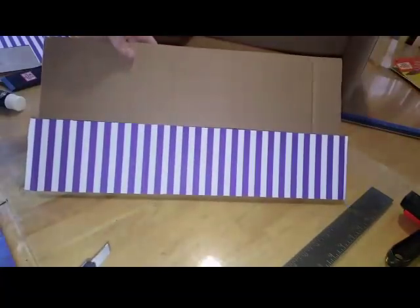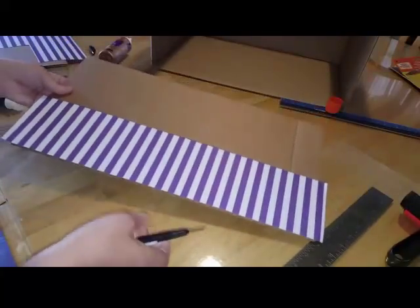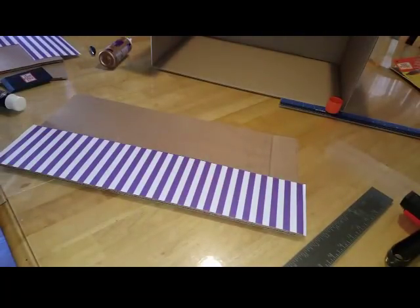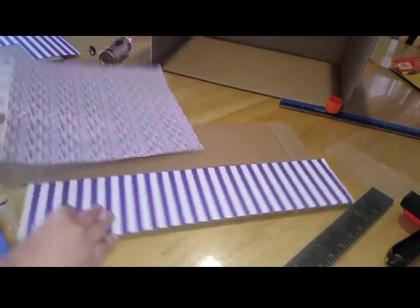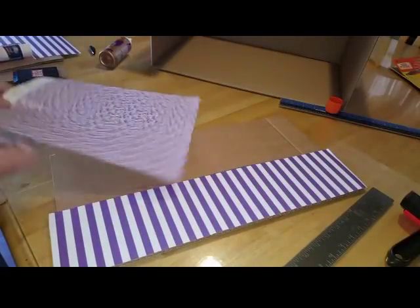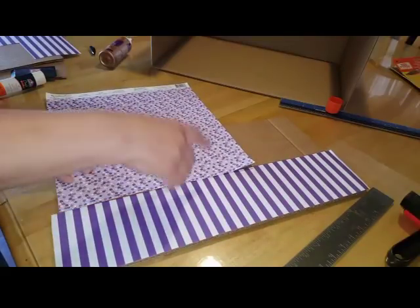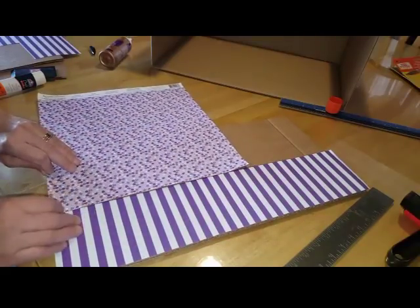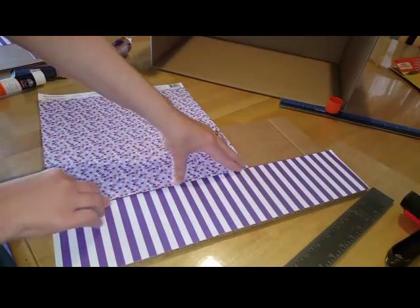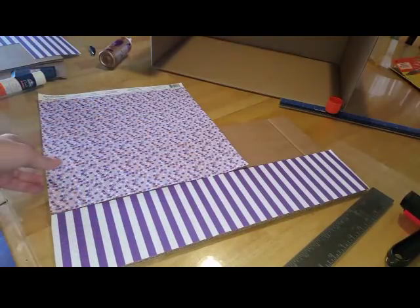You should come up with something that looks like this for the bottom wall. Now I'm going to show you how to do the top wall and then we'll move on. We're going to line this up the same exact way, then go across. Remember to leave it to overhang just a tiny bit. If you don't meet it exactly in the middle it's not a big deal because we're going to put some trim there.